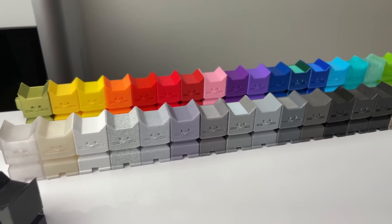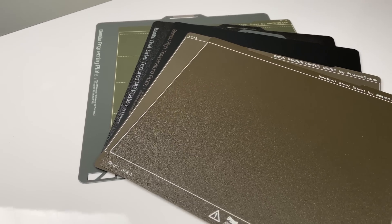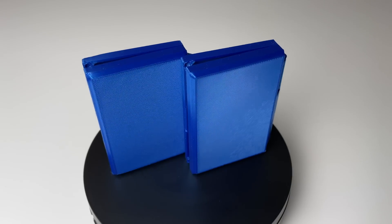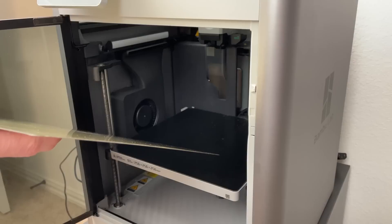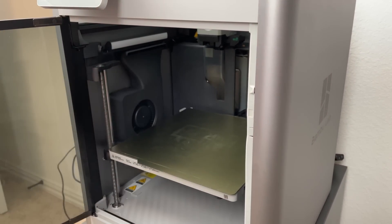Yes, I have too many of them — no, you can't stop me. Last step for preparation is choosing a build surface to print on. With options like glass, smooth PEI, textured, and satin sheets, you can achieve many different looks and textures. To hide the most lines, I print on a textured PEI sheet, but if I need a smooth gloss finish I'll use a smooth sheet — this just depends on the look you're going for. Just make sure your first layer calibration is spot on to minimize any kind of warpage, elephant's foot, or anything else that will give away your part as 3D printed.